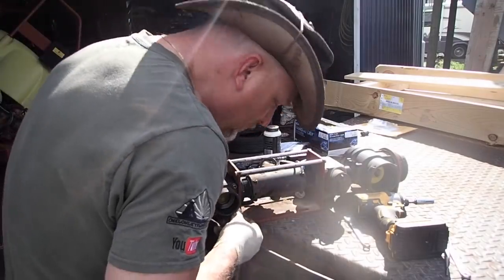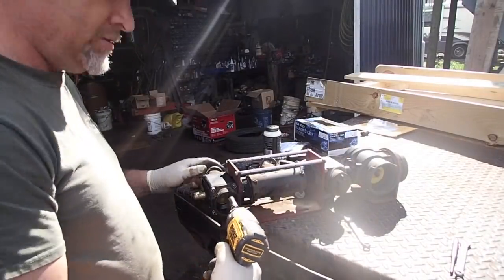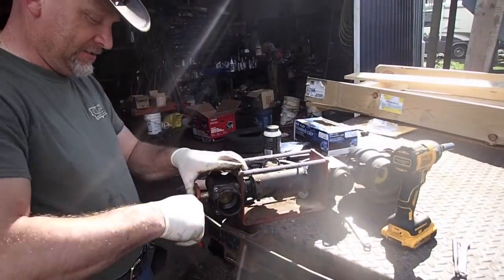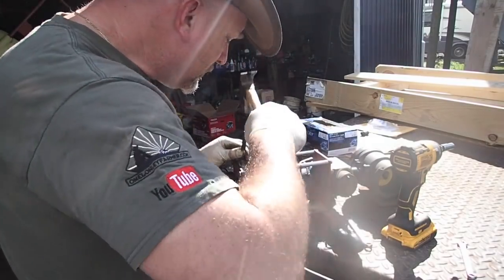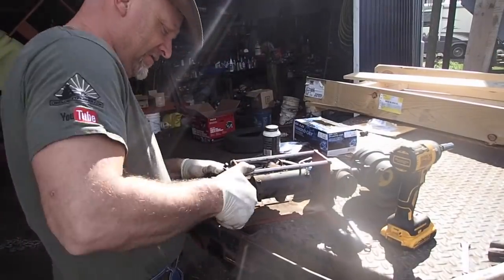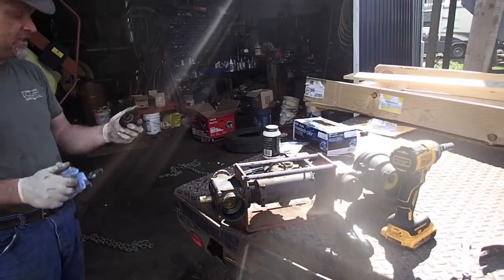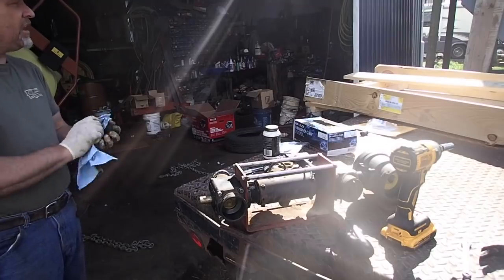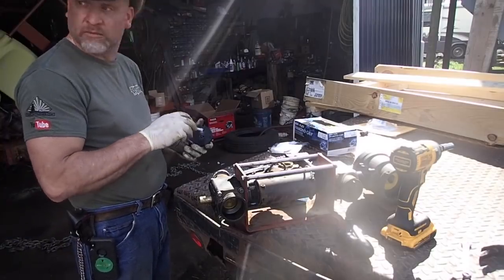Yeah, so in the other, I probably don't even have to tear the whole entire thing apart. I can probably just loosen the bolts up and slip the shaft out of the slot, because that's all it will take to do. But when I get it apart, I think that's what I'm going to end up doing. Do you see that thing I'm tapping on right there with the hammer? That is what tightens it up against the mounting bracket. If I loosen that screw up and pull the valve up or open or away, that will actually slip the shaft out of its position, and I can just turn the handle 180 degrees and fix my problem. I don't actually have to tear the whole entire thing apart.